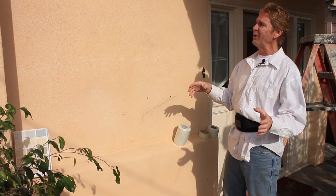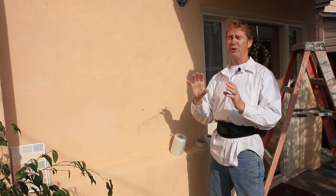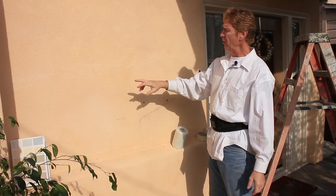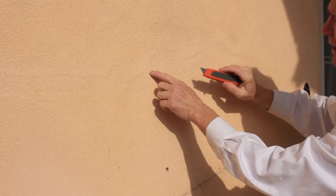We're here because the fella in the rear — we did the color coat a couple years ago, and a downspout failed. They're putting a new downspout which put a little hole in the stucco for us. So I stopped by and looked at it, and I noticed the hairline crack right here. There's one there that the camera won't show because I can barely see it. You see this crack, it starts right here. It's a hairline crack, like the hair on your head. And here you can see the fiber mesh tape.